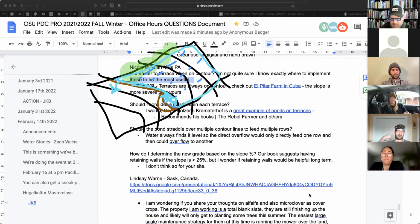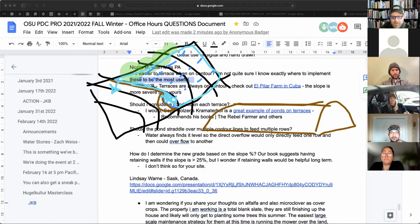And a level sill spillway looks like, so we're just keeping up with the conversation. So if this is our swale, and we have it in cross section here, so this swale goes all the way along here, what'll happen is we'll take out a chunk of this and we'll basically level it off, and we'll armor it. So we'll armor with rock, and basically we'll smooth it out so that way in overflow it doesn't even move a blade of grass, because basically we want to keep this water in what's called sheet flow. We don't want it to go to a rill or a runnel or channelization. We want to keep it in sheet flow so that way it can't erode.